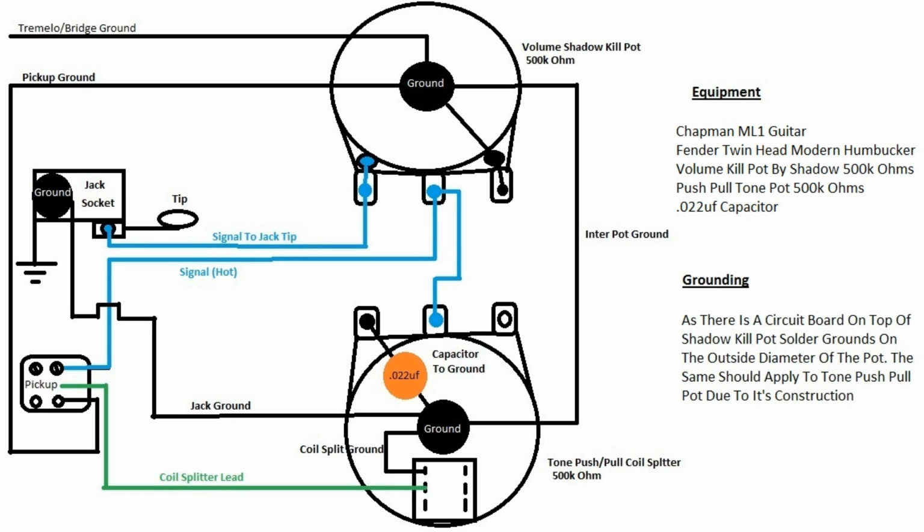Now the way it works is this: if you look at the back of the pot for the tone push-pull, you will see a square at the bottom of the pot, and in that square there are 6 vertical lines. These actually represent terminals on the block, and they're not orientated that way as you're looking at them. They actually sit at 90 degrees away from us, so that the top 2 terminals, as you're looking at them there, are closest to the pot, and the bottom 2 terminals are furthest away. Okay, so we're going to connect that lead to the centre of the left-hand terminals, and we're also going to connect a lead from the top left terminal down to ground.